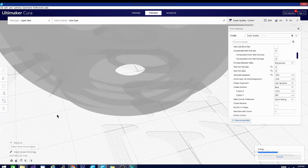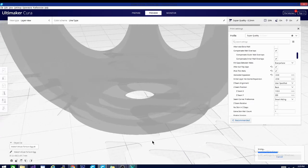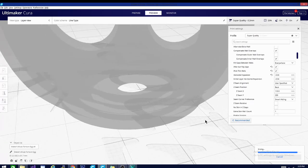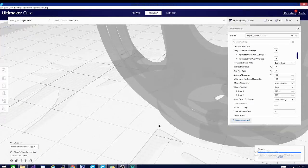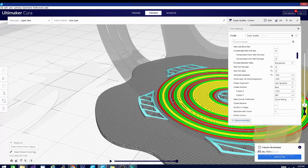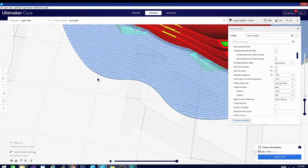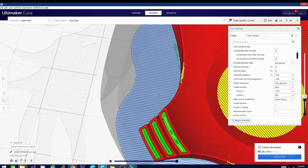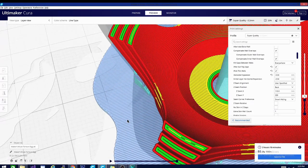I have also made it a positive value on certain prints. The reason you might want to do this is if you have a nut and a bolt and they are just a little bit loose fitting — you can increase the horizontal expansion on just one of them slightly to make the fit a little bit snugger. So this is about to finish and we'll see what it looks like with the minor horizontal expansion. It should look a lot like the first picture — we'll get at least two extrusion lines, probably three. Back up to layer 73: you can see there's a lot less gap. It looks like we're getting two to three extrusion lines depending on where it is in the arc and how wide it is. That's not bad — I think this would print properly.